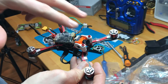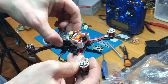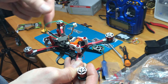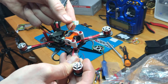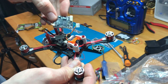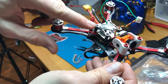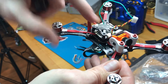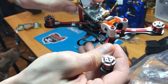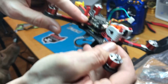So I'm going to get the receiver installed. The first thing I did is take out the four bolts on top and get the top off. Then you're going to pop your TBS Unify Pro off and pull this cable out. I actually added a new cable to mine — the pin next to the yellow pin — because I'm going to add smart audio so that I can control this board through my Taranis radio.